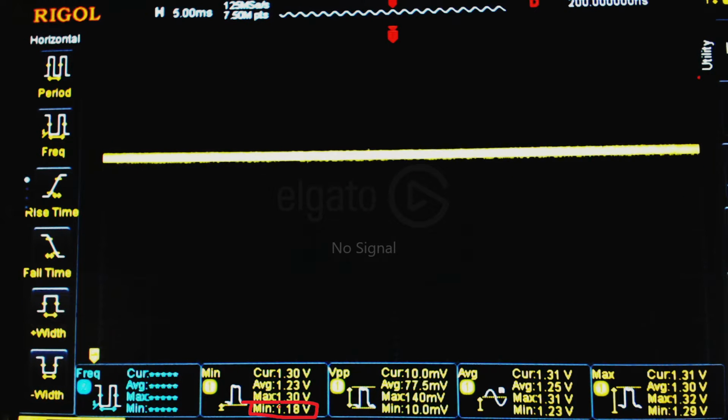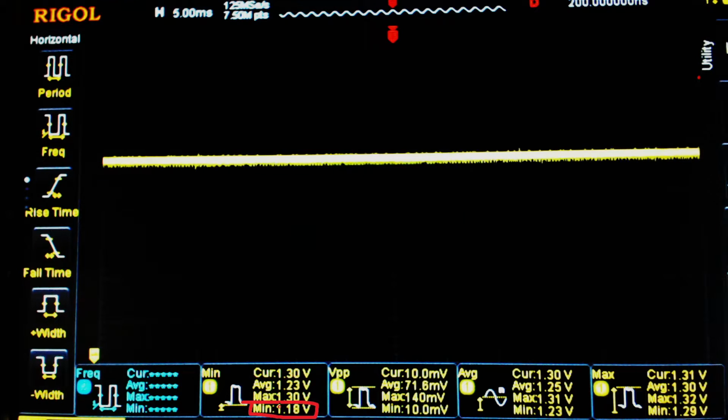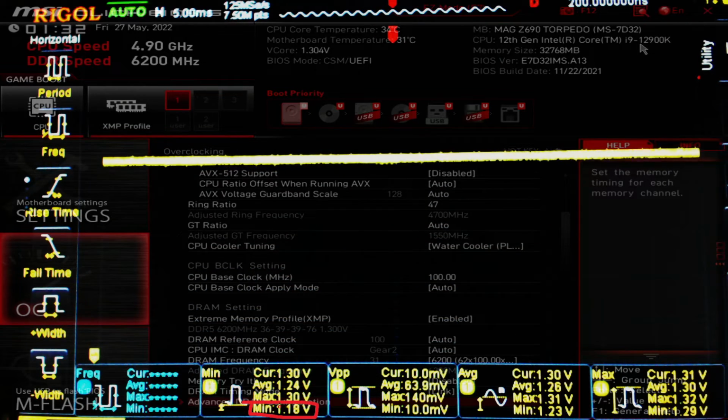But it does mean I probably need to reevaluate my overclocks on this motherboard, because for a lot of them I was using 1,000 kilohertz switching frequency, and now it's like, nope, that was definitely not the optimum method of doing things. Admittedly, I was using a very, very droopy LLC, and the effect is much less. On mode 3, the difference between 1,000 kilohertz and 500 kilohertz is far less, and on mode 4 and 5, it's basically impossible to see it.